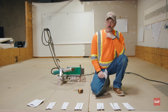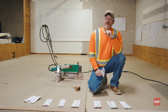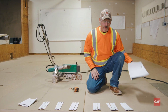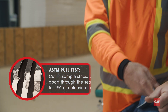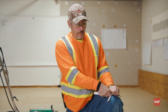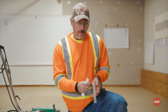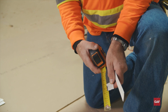We've done all our test welding, and Dave cut these up into one inch wide strips. This is our field test. You really don't want to take your membrane and pull it down the seam — this is the way you actually want to test for film tearing bond on your seam. This is an actual ASTM test, so we're making our own test samples. I'm going to pull them apart and see how much pressure I have. Obviously at 600 degrees at 10 feet a minute, I had nothing. At 700 degrees, I've got about an inch and a half delamination — that's our target. I believe we found the bottom of our weld window at 700 degrees.